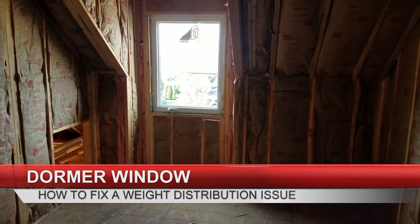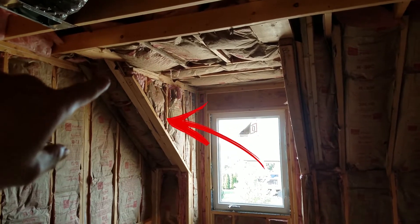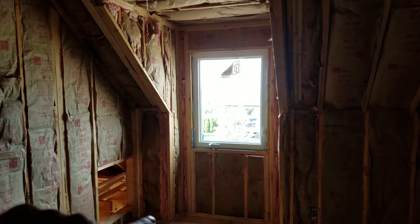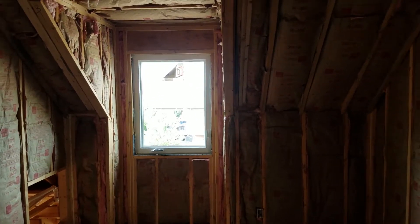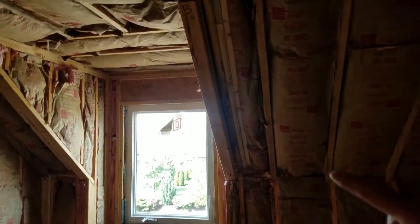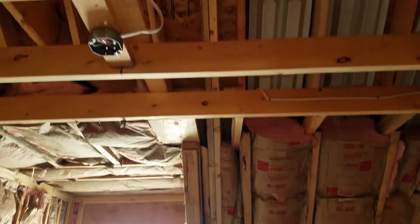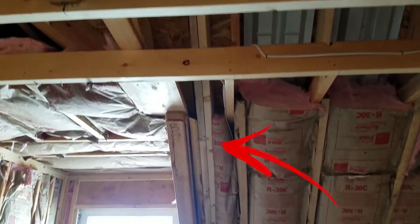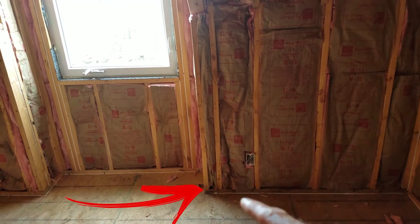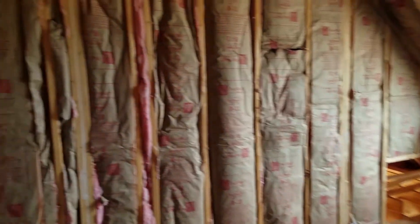Here's a built-out in the second floor bedroom. The issue we had was the weight distribution from the roof carrying down into this angle and into these beams — it was not built strong enough to withhold that weight. So what we needed to do was go back and do what they call 'sister' — sister the two-by-sixes into the ceiling. You see right up here, we had one that was existing and we basically put another one right next to it and a third, and nailed those together. That allowed the weight to be distributed from the point load all the way down through the ceiling into the floor. Problem solved — a simple kind of fix, but it's important so that everything is built the way it needs to be.